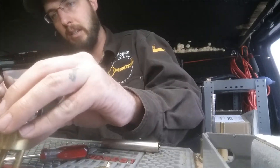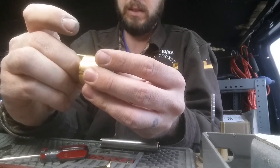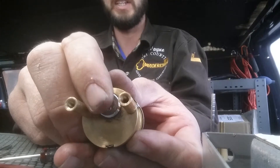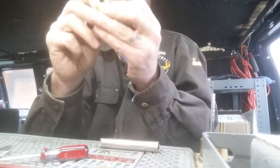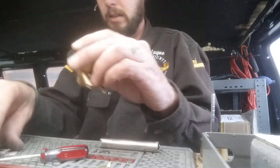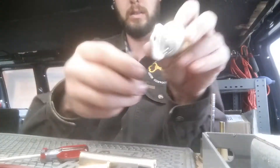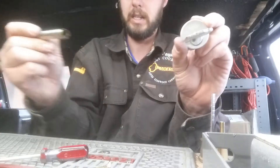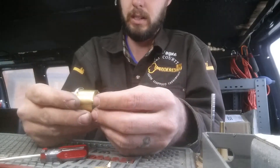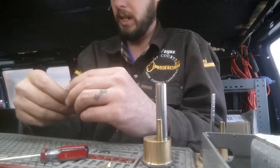Dump the retaining pin. If it doesn't want to come out, that's kind of odd — that's the retaining pin that we're trying to get out of there, so we'll just leave it in there. Then we'll get our original working key, slide that in just like so, rotate 90 degrees, insert follower, and follow the unit out, keeping all the pins in the top where they're supposed to be. Remove the key.